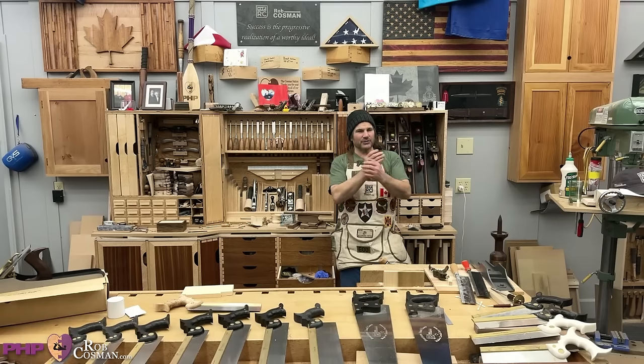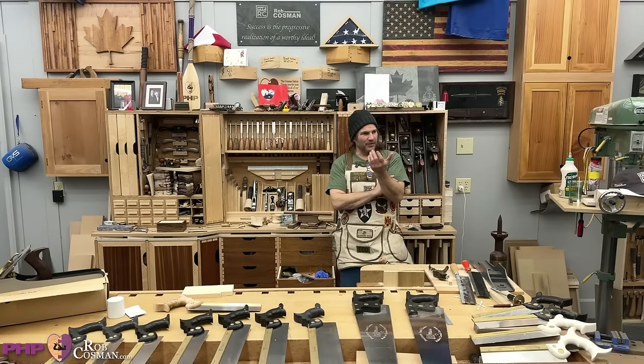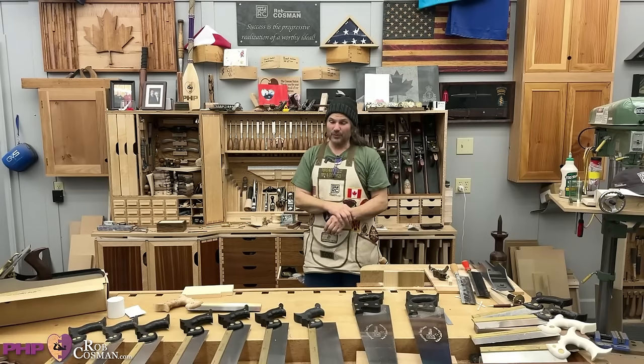It's one of those things where I will take the time to cut dovetails because they're shown. As soon as you, remind me to show them our locking system, please. You see the dovetail every time you open the drawer, every time you look at the cabinet. But when you consider the fact that this thing is never going to be seen, yes, you could leave it so that you see it at the front. But I don't think they're worth the bother.